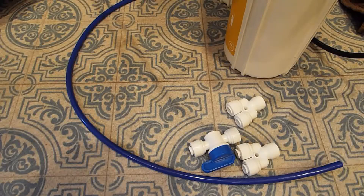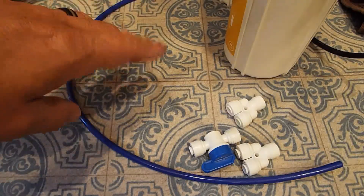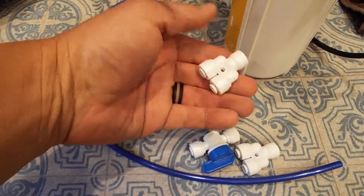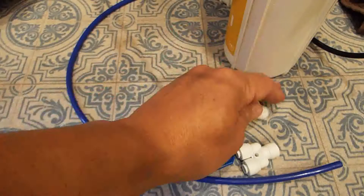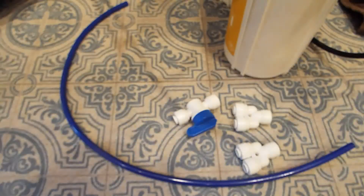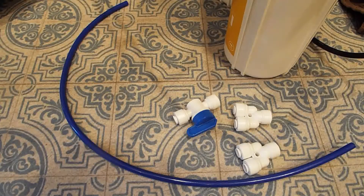To install this valve you're going to need some extra parts and I'll put a link down below in the description for Amazon so you can find some of these parts. What you're going to want is a couple of T's, a valve, and a little bit of extra tubing. Let's go ahead and show you how to use these quick connects if you haven't used them before, and then we'll get started with bypassing the flow restrictor.